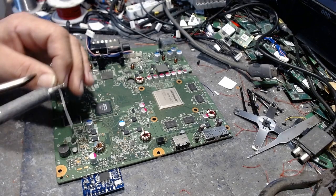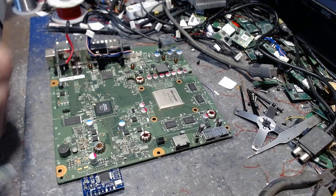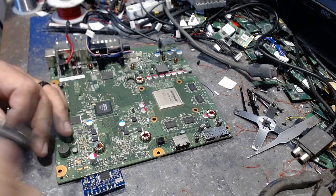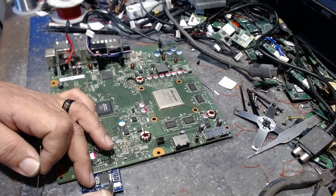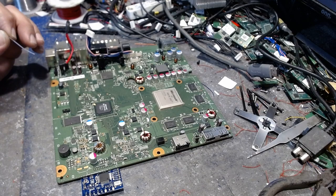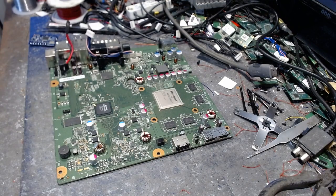Okay, now as I said, we're going to take the oscillator out of the chip. So what we have to do is add a little flux right here. And see, you don't have to, but I do anyway. All right, just for the hell of it. All right, and we get rid of this little jumper right here. There it goes, and it's gone. Okay, so that way then we can use the clock on the board. Now, go ahead, get our chip out of the way.